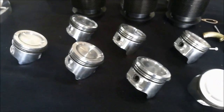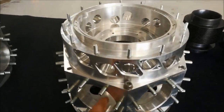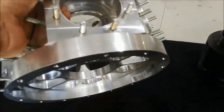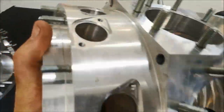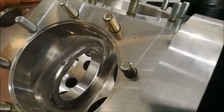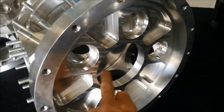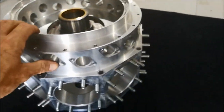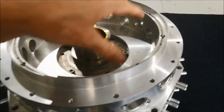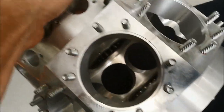Pistons here, and a 2800 crankcase ready to take bearings and be assembled — a nicely made piece of 6061 T6 aluminium. You can see all the lifters, accessory bearings on the back, and the crankshaft roller bearing. The R3600 crankcase is exactly the same. The cam spigot is roughly in position — that's what the cam would spin on — same philosophy throughout.